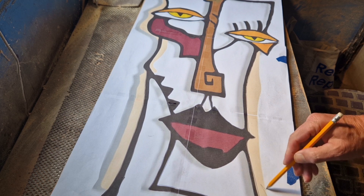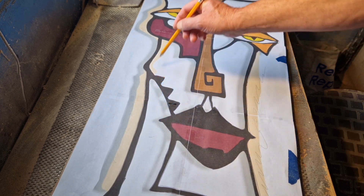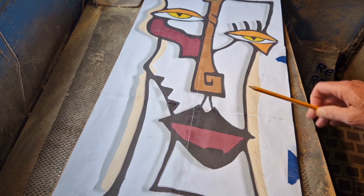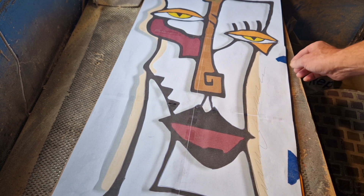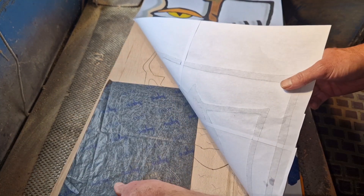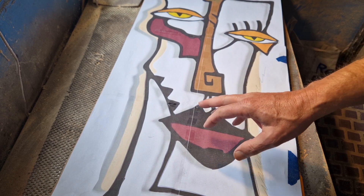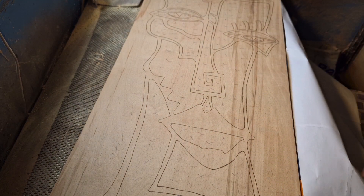We're not interested in these outer sections — those would be cut out with a scroll saw at the end. We're going to route all these sections out and inlay them with the appropriate color resin. As always for me, we've got our image here, stuck down with a bit of painter's tape. This allows you to just flick it over. I use carbon paper — I placed six pieces on this one, all the way down, and then drew around it. Carbon paper and tracing is the easiest way for me. Remove the template and there's our lovely image underneath.